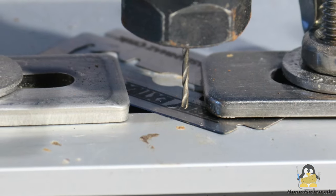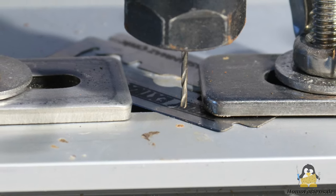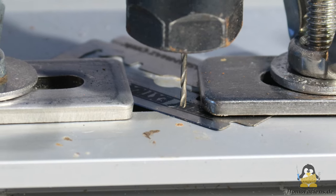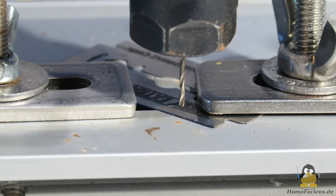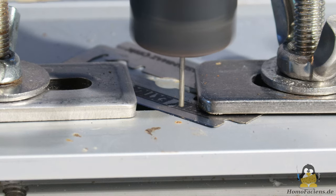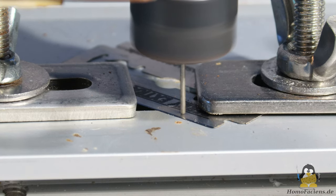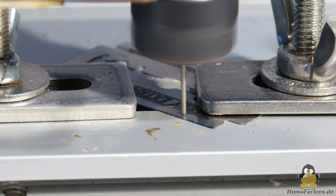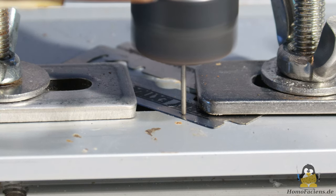My material of choice to drill a hole in is a hardened steel razor blade with a thickness of about 0.1mm. First, let's try to drill the hole in the classic way. A 1mm drill is placed in the chuck and the Z axis is slowly lowered by hand while the spindle is running. The tip of the drill dances on the steel surface instead of penetrating at the intended point. After a while, the drill finds a spot where it can remove a bit of the steel and comes to rest in that tiny crater, but then not much happens.